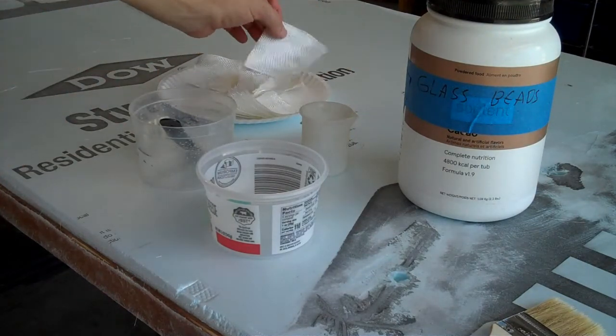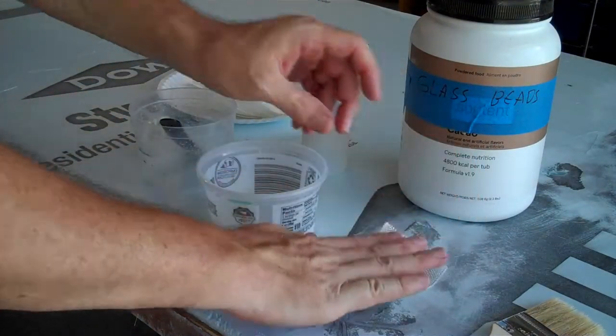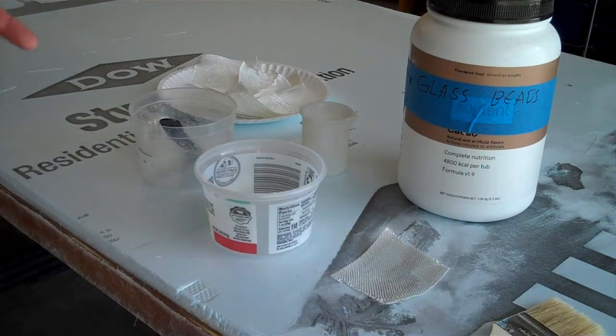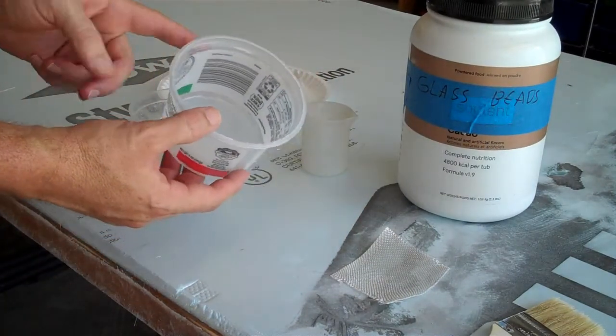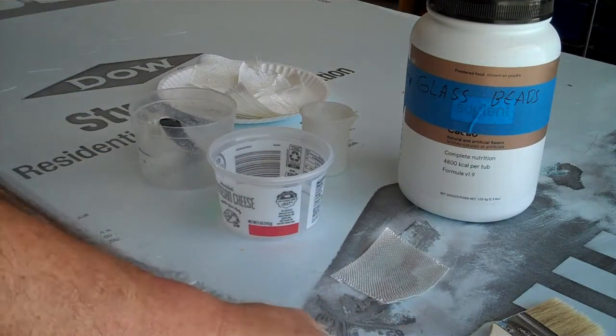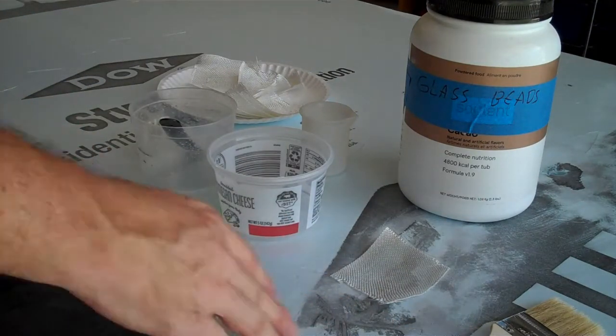After that, I'm going to be putting these guys on top of the holes, just a little bit of extra support, tie them all together, because I can do it right now. And then I'm going to put more glass beads into the remaining epoxy, make it into a putty, and use that putty to smooth the edge between the foam and the fiberglass on the back here.